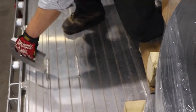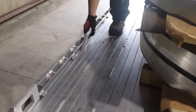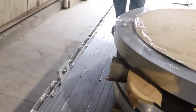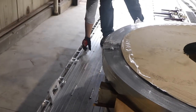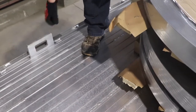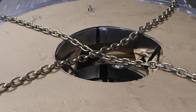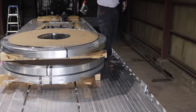The first step to securing skidded coils is to place your J-hooks in the J-hook channel. There will be three J-hooks on each side of the coils. Working from the front of the coils to the back, you should place your first J-hook in the first fourth of the coils. This will serve as part of the required X over the top.